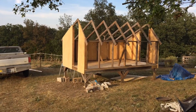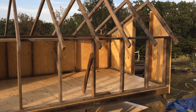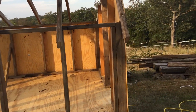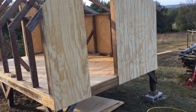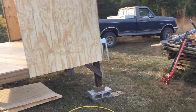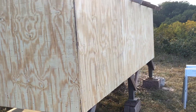Here's a quick walk-around of the chicken coop. It's an 8-foot by 12-foot interior floor space with about 6 feet of headroom. Nest boxes are going to be along this wall with windows along the top all the way across. The nest boxes will be accessible from the outside so we can collect eggs without going in. That's going to be the human door inside the run, and there's going to be a little chicken door right there. This will all be fenced in about 25 feet by 25 feet to start. Where I'm standing now will eventually be inside the run, and this is the back side — the north-facing side of the coop.